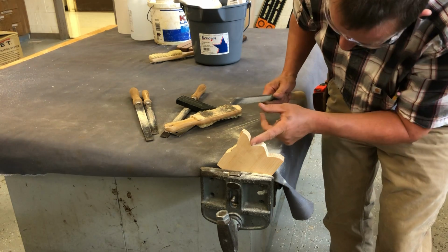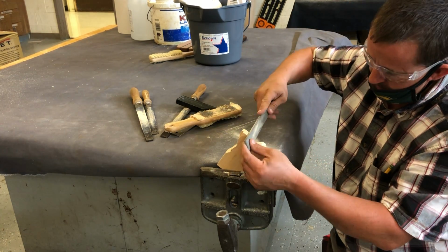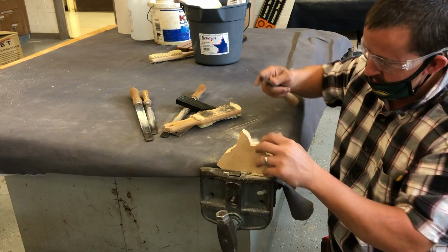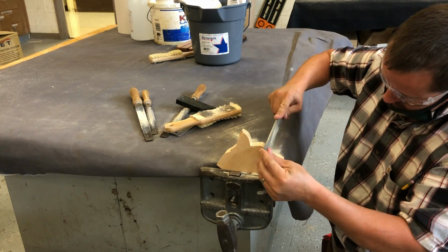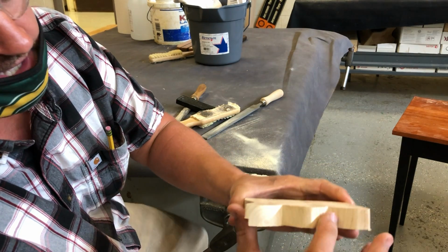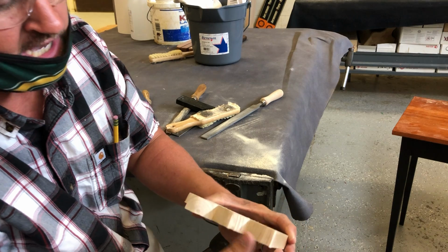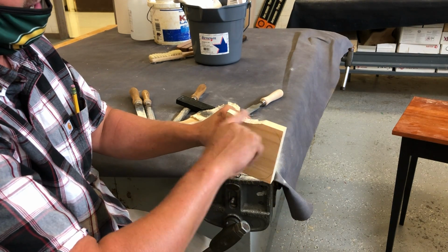So this is looking pretty nice down in here. I can still see that I have a little bit of a relief cut down in this point, which means I want to file a smidgen right there. That one looks like it went away. That one looks pretty nice. I'm pretty satisfied with my top at this point. I don't really see any relief cuts or anything like that. I don't have any big grooves down here. I'm decently satisfied. I might go to a little bit softer of a file a little bit later, but we're going to move right onto this section right here.